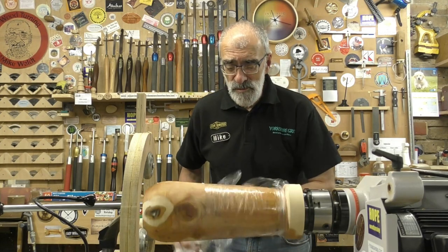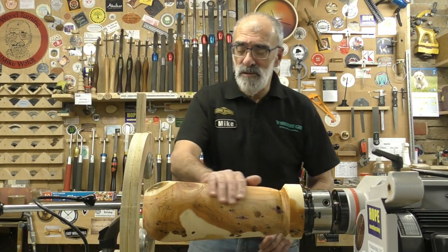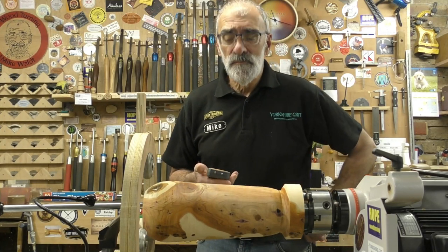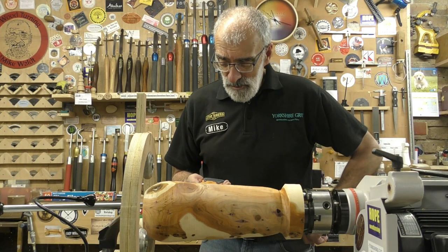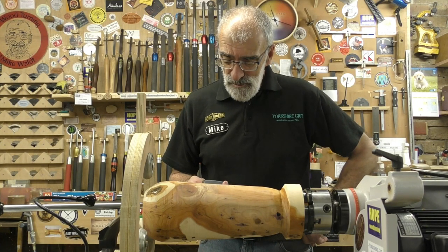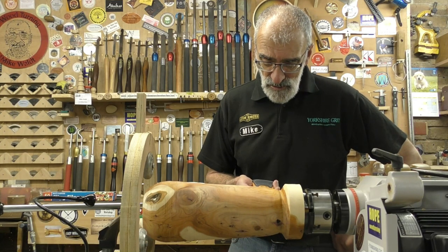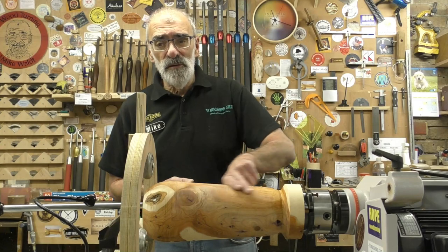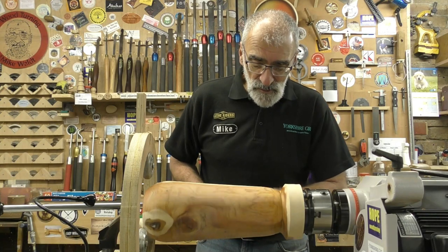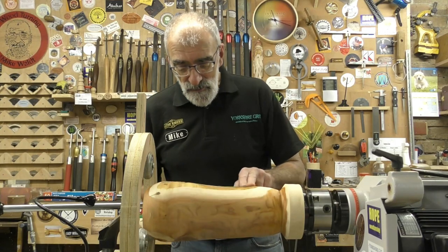It would be interesting, I suppose, just while we're here, before we carry on hollowing out. I left the shavings in there as well from the last. It's really damp on top. Just check the moisture on the outside. And it's 17-18%, and down the bottom here is the same. So during the turning, and since yesterday morning, it's actually lost 6% in moisture, and there are no more visual cracks at the moment.